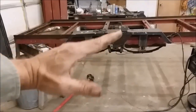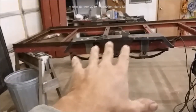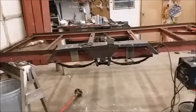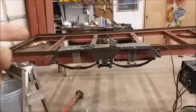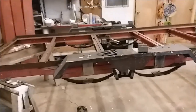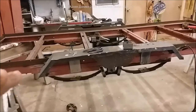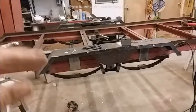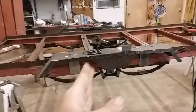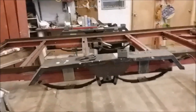As you're going down the road, they don't want to follow the road as well. The slipper springs did work and we've used them quite a bit. I did haul this out of town about 450 miles and back - worked fine, didn't have a problem with it. However, say you turn corners and things, it doesn't want to haul right. Expansion joints in the road were pretty rough on it because of the slipper springs not responding equally.